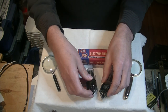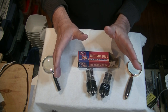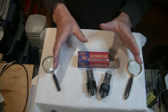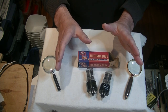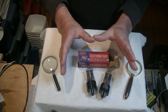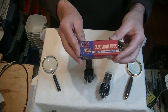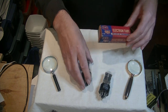These are both 12SN7s, and that's a really good thing to talk about. Vintage 6SN7s of quality — new old stock or testing new old stock — are getting harder and harder to find at reasonable prices, and it's only going to get worse. If you're rebuilding an amp that uses a 6SN7 or building a new design, think about changing the heater voltage. The only difference between these tubes is that the heater voltage is 12 volts instead of 6. For the same kind of money you would spend on a testing new old stock vintage 6SN7, you can probably get a brand new in the box 12SN7 — still going to cost money, but you'll get a much better quality tube.